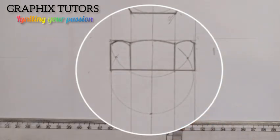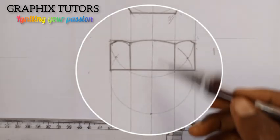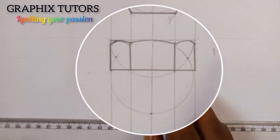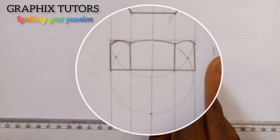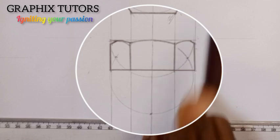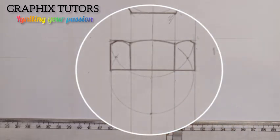Now I'm going to draw them straight down, from here to this point straight down, and from here to this point also. Now I'm going to close the base. This is the cup of the nut. Now the next thing is for me to draw the shaft. Since it is 24, we have 16 here, so I'll measure it to the left and right to make up that 16.